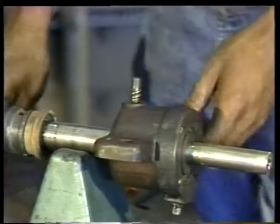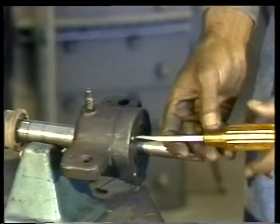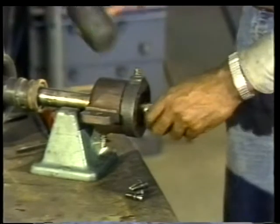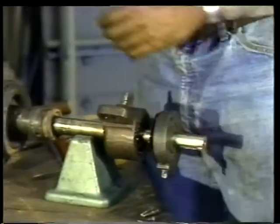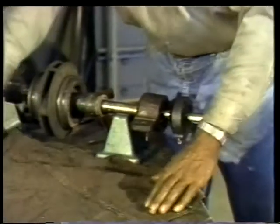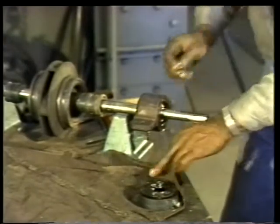With the flinger out of the way, you can remove the end plate on the bearing housing. This end plate is held in place by four screws. As always, keep these screws together in one place after you remove them. If the end plate can't be pulled off by hand, tap it gently with a soft-faced hammer until it comes free. You should know that dirt and grit can easily ruin an otherwise perfect bearing, so don't simply put the parts of the bearing assembly with the other parts of the pump. Instead, protect them by setting them on a clean rag.